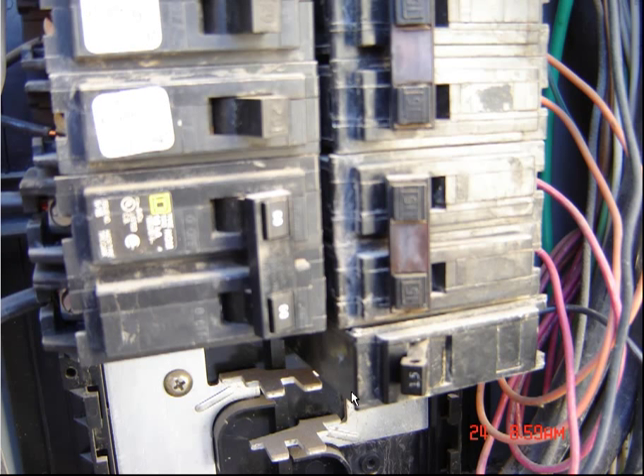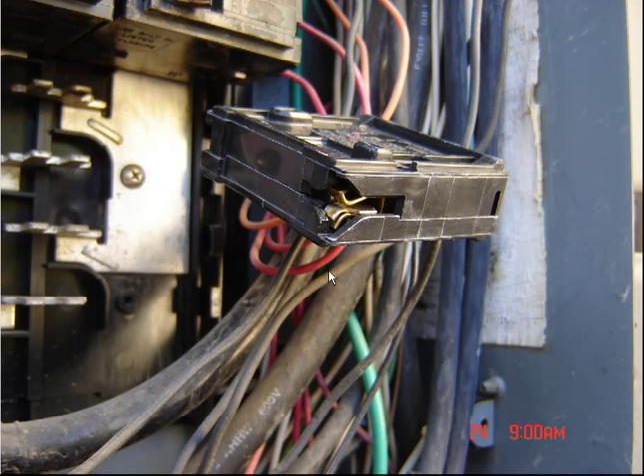Take a quick look at this next picture — once again, it's sticking out quite a bit there. General Electric breaker, I don't know what that is. So I switched it out with a Square D Homeline. Here you can see the slot is deeper in through there, which will allow it to seat properly down into that, so that'll push all the way up into the connection point there, and that slot there will allow for it to seat properly.